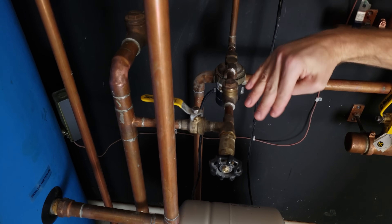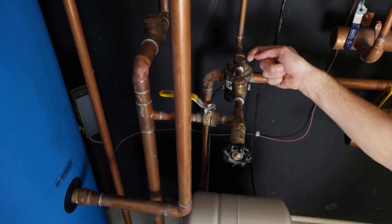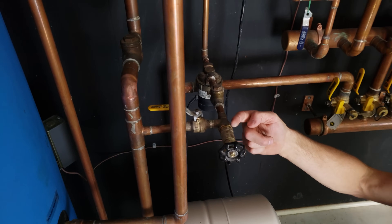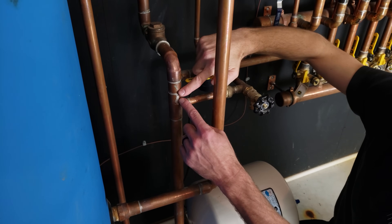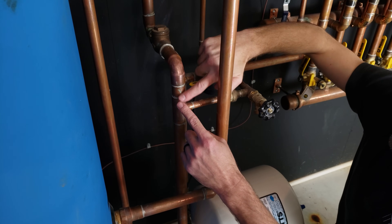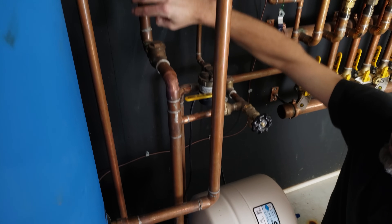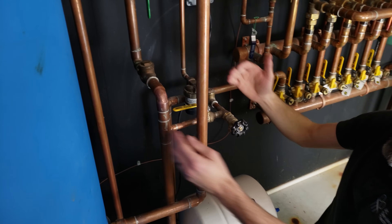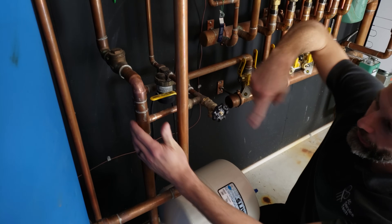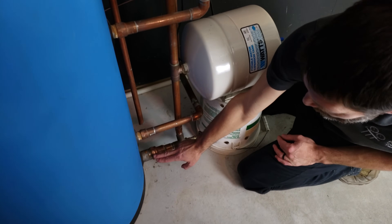This is a one-way swing check valve, making sure the water only travels in one direction. There's a drain, then a valve, and it ties back into your cold water line. It's not going to force water back the other way because of the swing check valve, so you are continually recirculating the hot water and putting it back into the cold water inlet.